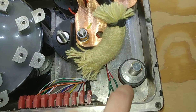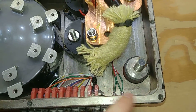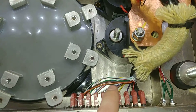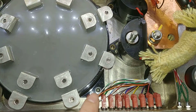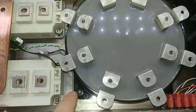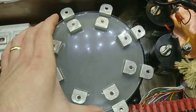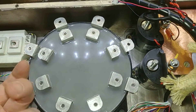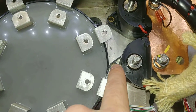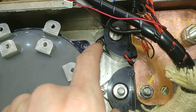We were wondering if this was machined out of a solid chunk of aluminum - it's not, it's cast. You can see the aluminum casting here and then they came back and machined and milled the surfaces flat to mount everything in there. Interestingly, there are mounting holes here for this big capacitor - they're drilled and tapped - but it doesn't look like there's ever been a bolt in there. It's just siliconed in, so you can actually move it around. That might be just to accommodate tolerance stack-up.